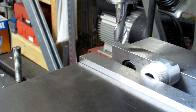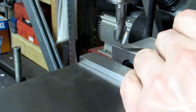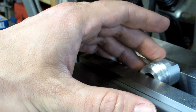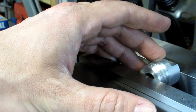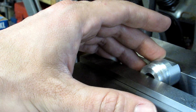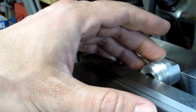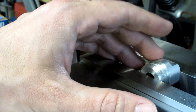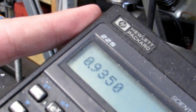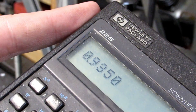I'm at 349 thousandths there, and measuring 971 thousandths on the flat. On my flats I have plus nothing minus ten — that's to make sure the wrench actually goes on. I'm shooting for 745 thousandths, which is the middle of the tolerance. That means I've got to take 190 thousandths off of each side, so the measurement I'm shooting for is 935 thousandths. I came in at 971, which means I've got 36 thousandths to take off.